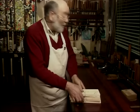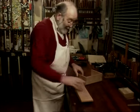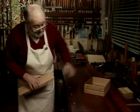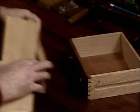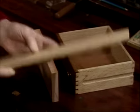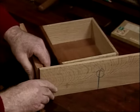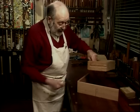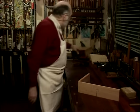We'll have some nice wood. There's the drawer from my toolbox and we're going to talk about this corner. This piece will be the drawer front — this nice piece of mahogany — and here we've got a nice piece of oak. We usually make good quality furniture with oak drawer linings because all the weight of the drawer keeps rubbing here and oak wears extremely well.